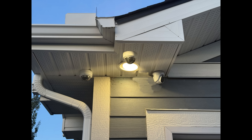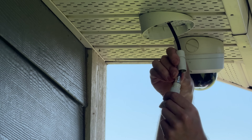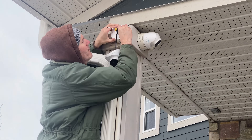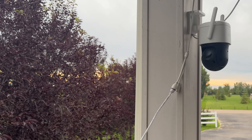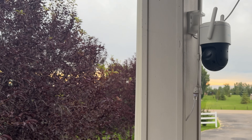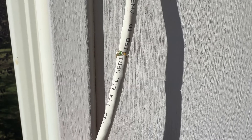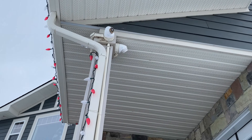Number eight: exposed cables. Ideally any cable should be hidden in an eave, a wall, or even in a junction box. Here's a quick time-lapse of an install I did a few years ago, keeping all the cables enclosed and neatly in junction boxes and conduit. If you must leave cables exposed, make sure at a minimum they are out of reach — when they're low, somebody could walk up and disconnect or cut them. Don't forget that exposed cables will have their plastic coating rotted away by the sun's UV. There's also a level of satisfaction found with a neat install when there are no cables lying around or exposed.